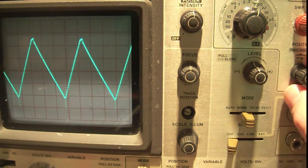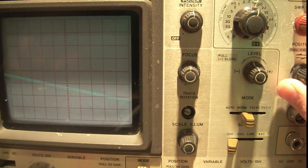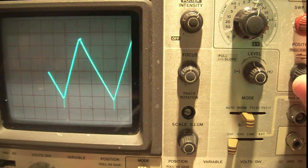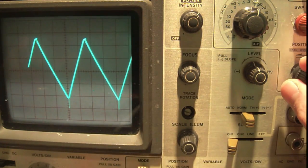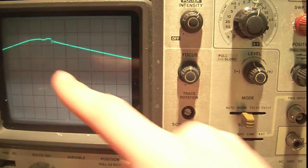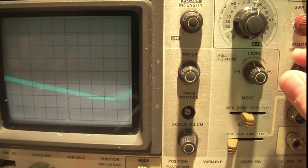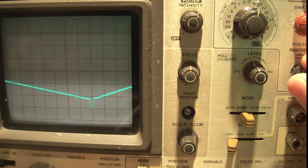have, which is this mag knob, right? This is normally the horizontal position knob, but if you pull it out, it actually magnifies your signal. So you have to turn the intensity a bit up for this. You see that little spike right there? If we pull it out, oh sorry, this mag knob is a bit jerky. You can see it's magnified the time base by times 10. So now you can actually see the full signal times 10 magnified, and we can actually see those little things.